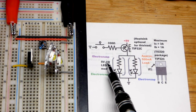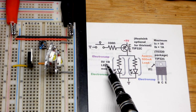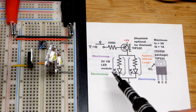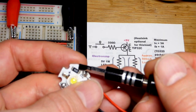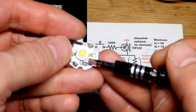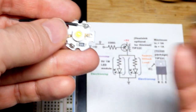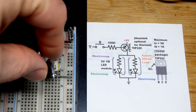At five volts, one watt — wattage is voltage times current, so that's 5V × 0.2A = 1W. These LEDs are passing about 200 milliamps each. They're resistor-based: the LED drops some voltage and there's a 6.8-ohm resistor on there. The marking says '6R8' — the 'R' replaces the decimal point, which is a common convention on small components where a decimal point might not be visible.